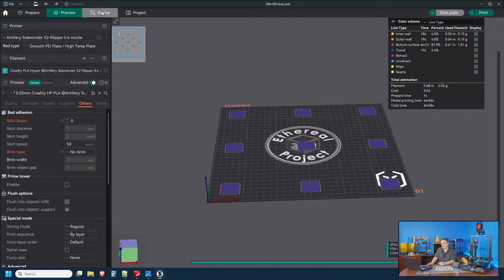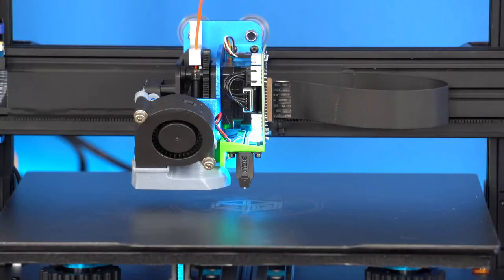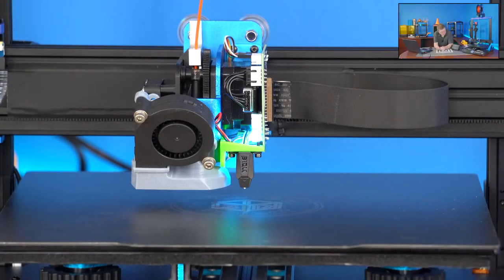This will be interesting to see where Cura puts the purge line. Because I have the purge line 35 or something millimeters in front of the nozzle, but it knows to put it out of the way of the print. So is it going to find a spot somewhere where it knows there's not something? Very curious. We are heating up. Because I have printed something that took up most of the y-axis, and it knew that, and so it put the purge line away, knowing that.